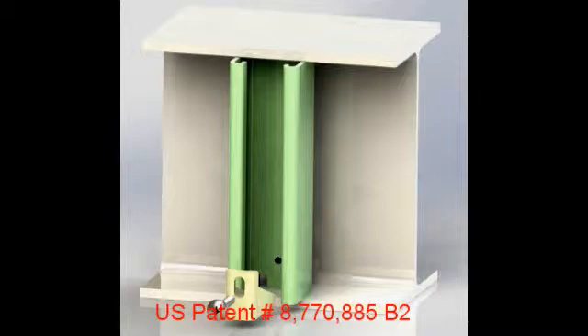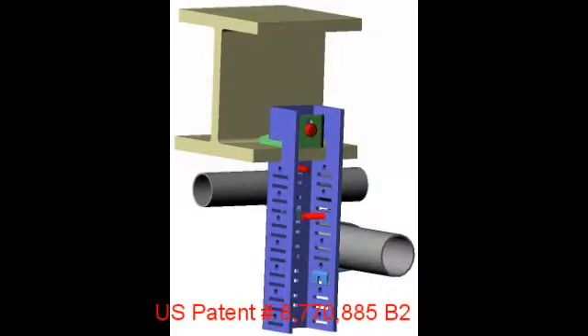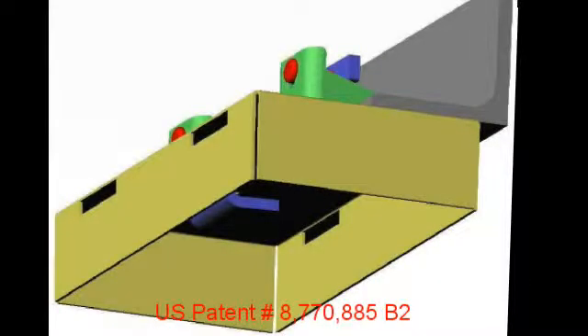You can make two inserts or make one if it's a longer distance. It's useful to create strut channel standoffs for attaching to either tapered or straight flanges by using the wedge either above or below to maintain a right-angle position to the flange. A wedge clamp can also be used to attach electrical or light boxes to structures — a metal box with rectangular cutouts can be attached using a special wedge clamp that sticks down into the slot.